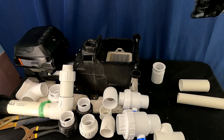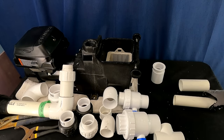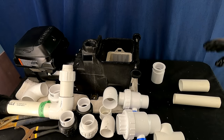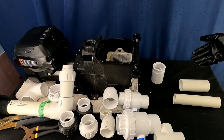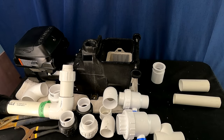In inch and a half PVC at 6 feet per second, that equals approximately 38 gallons per minute maximum. Two inch PVC being larger can have up to 65 gallons per minute at 6 feet per second. In addition to being safety limits, these numbers also coincide with the upper limits for laminar water flow. Laminar flow is very important — fast moving water creates turbulence and inefficiency, while slow moving water moves efficiently in laminar flow. When you exceed maximum laminar flow rates, you introduce inefficiency on a very large, rapidly accelerating logarithmic scale. The more water you push through a small pipe, the more friction and resistance to flow you encounter.